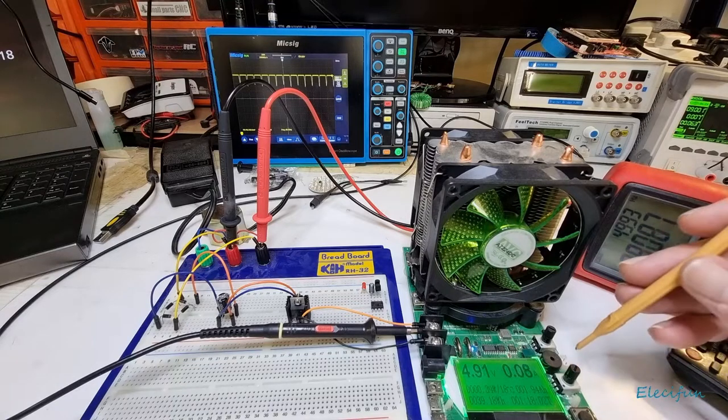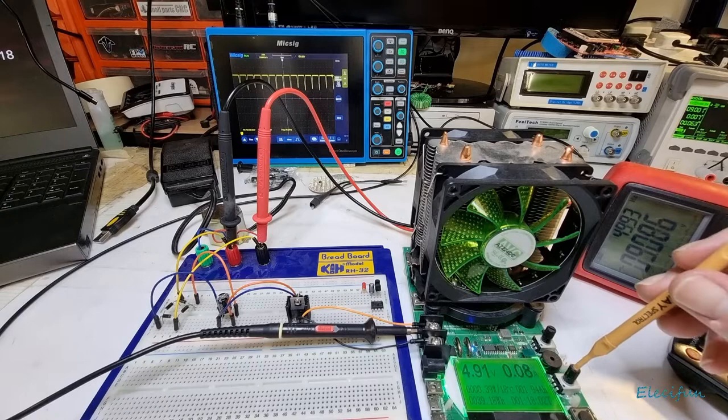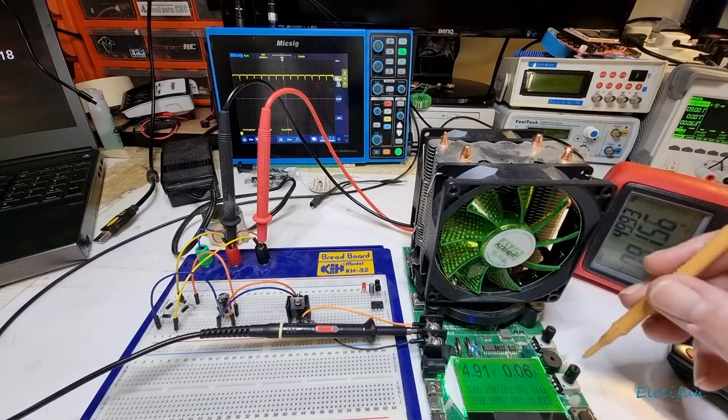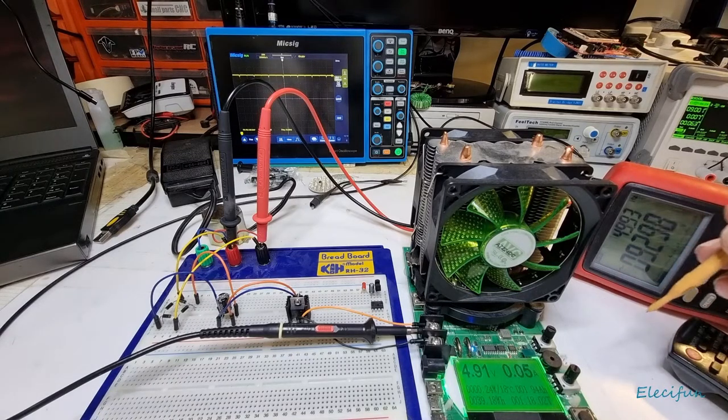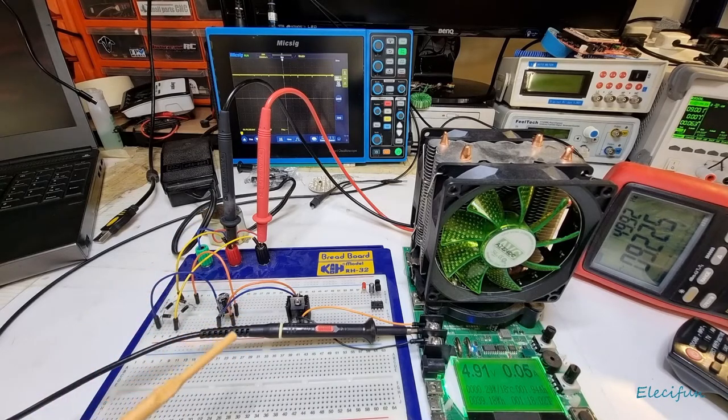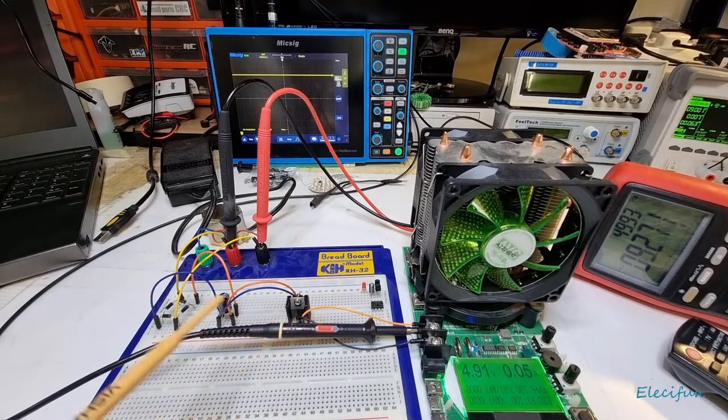Back to DC — that was 50 milliamps, then 80 milliamps. Let's back that off a little bit more and see what we can actually get out of this before it starts looking awful. At 60 milliamps it's borderline, so I think we're going to have to rest at about 50 milliamps. You can see the voltage is dropping, and the problem is the regulator won't work well because it needs its own overhead voltage — probably around 4 volts — so we always need a bit more going in.